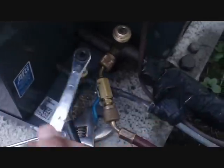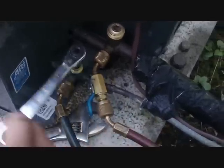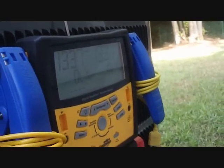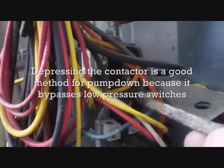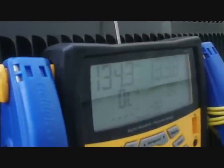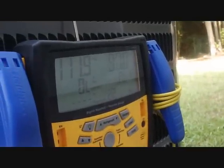We have our service tool shutting down the liquid valve, and then we will start it up. We'll shut down the suction valve when it reaches almost down to zero. I'm going to pump down the evaporator by depressing the contactor with my HVAC grade voltage-resistant contactor pusher — or stick, as I like to call it. I'll have to set down the camera because I won't be able to do this with one hand. You can see the effects of it here — it's starting to fall. The suction is getting closer to zero, so I have to shut it down.